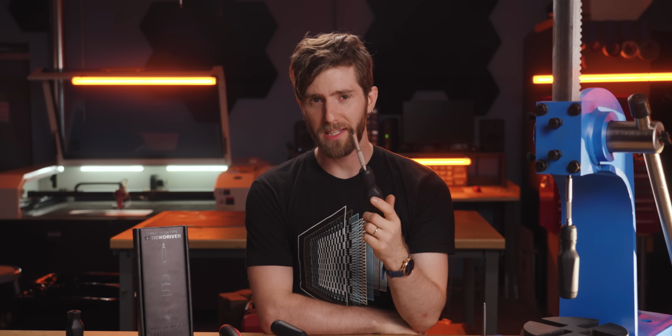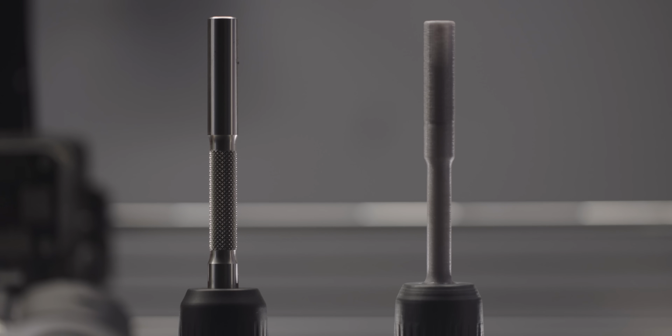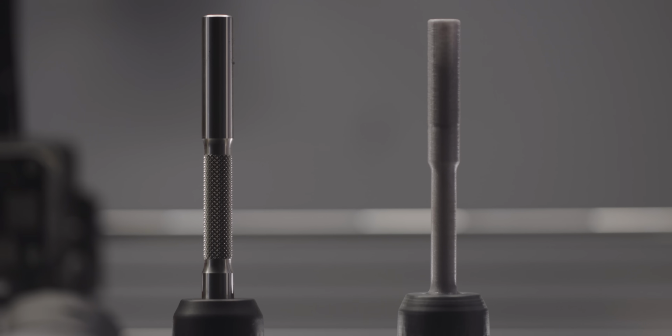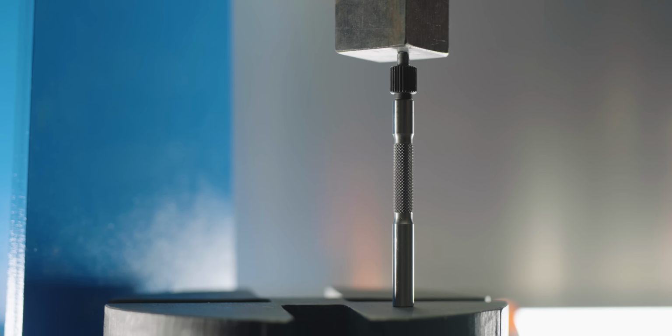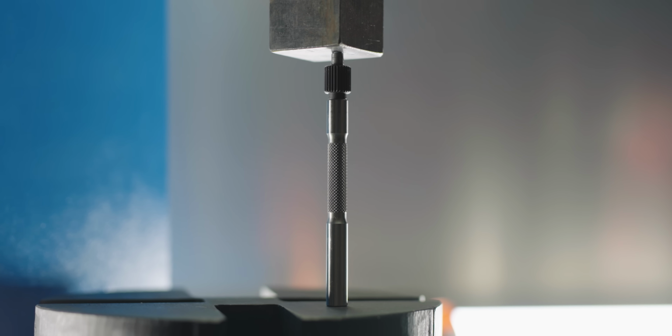While the plastic molds were getting made, we also had to finalize the shaft. You might have noticed that our original designs had the knurling go all the way up to the base of the shaft, but we added this little ridge here, and the reason for that was so that we'd have as much material as possible to hold the shaft onto the ratchet.